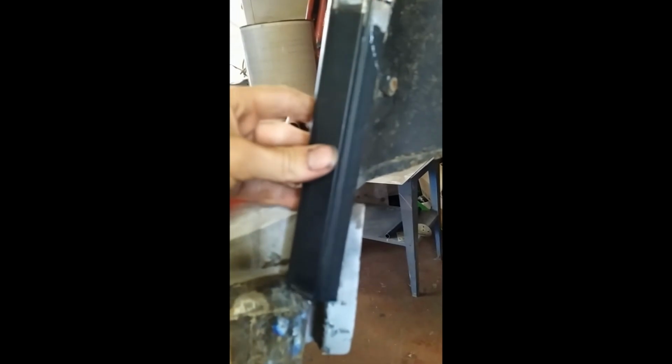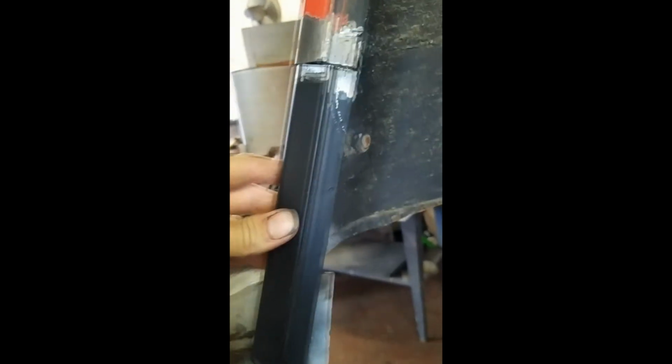There we go. That's going to go in there nice and neat and tidy. Get that nice and solid. And then I clean off this bit again. Another hole, bodged up and packed up with a bit of tin. And then buzz this off and weld the plate back in properly.